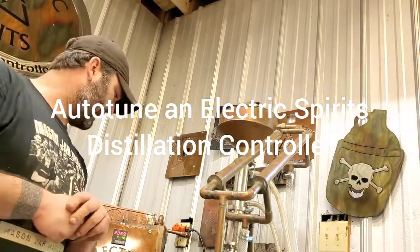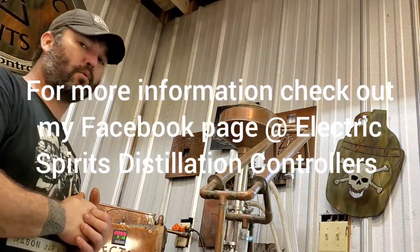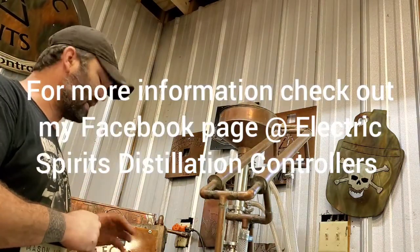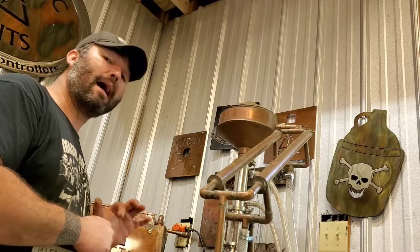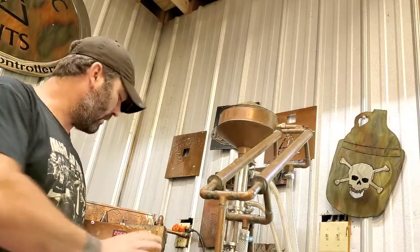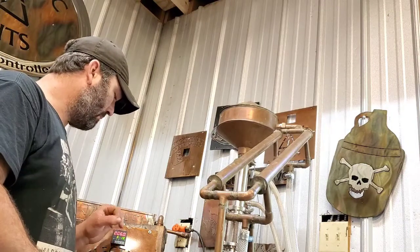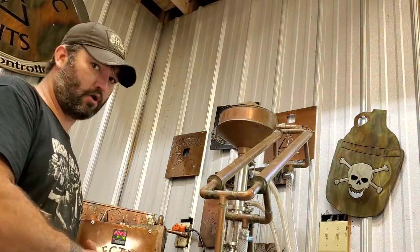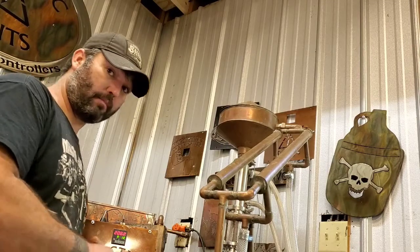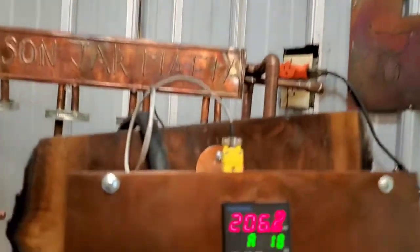Alright guys, Darren again. Right now we're running in manual mode. This video is going to show you guys how to go from manual to auto mode again, one more time. And we are going to concentrate on auto tuning our PID to run a more consistent temperature value from the thermocouple. Alright, so I'm going to grab the phone here and pan in.